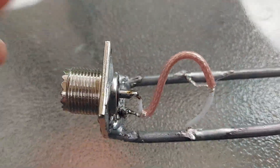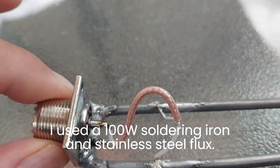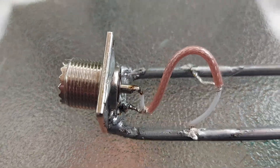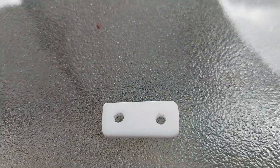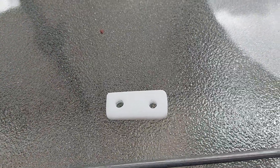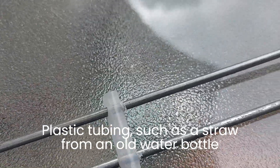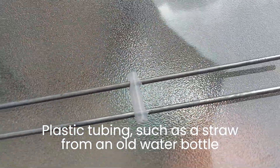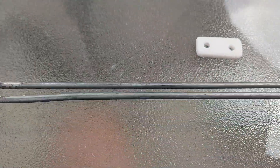The biggest mistake was soldering this connector to the antenna - it took a lot of effort and it's not soldered right, but it's a prototype so I don't care. I also spent half an hour making the little spacer, which was ridiculous when I could have just used a piece of plastic pipe. The spacer is there to make sure the end of the driving element doesn't short to the rest of the antenna.